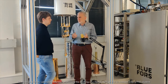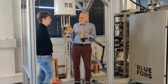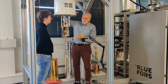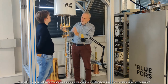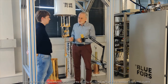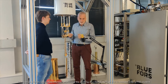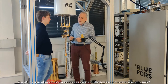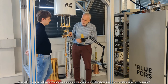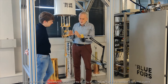That's the coldest liquid we're going to get on Earth — in fact, in the universe. Now, that's only the very beginning of this fridge. This step right up here is about four Kelvin, and all the stuff below here is about getting us colder and colder. When we get to really low temperatures, cooling by simple evaporation is no longer an option — there's nothing left to evaporate. This is called a dilution refrigerator, and in this little can here, we're cooling by a very special technique that only works due to a quirk of quantum mechanics.